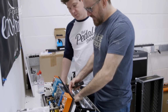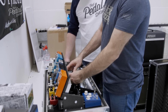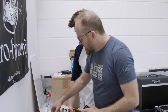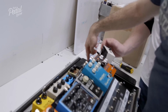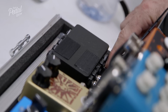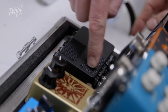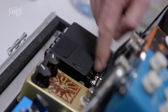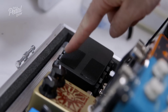So I can hide that underneath the tier here and just run the isolated output to this little Synco. Now what this is, if you can see behind here. It's just in and out, isn't it? Yeah, this is a little 5 in 5 out patch bay. The cool thing about this, it also does TRS connections as well. But all the outputs are isolated from each other. So, for example, at the moment, this is outputs 1 and 2 from G2. Yep. So when I plug my out to my amp, it comes out of there for amp 1, and that's there for out 2. Exactly.